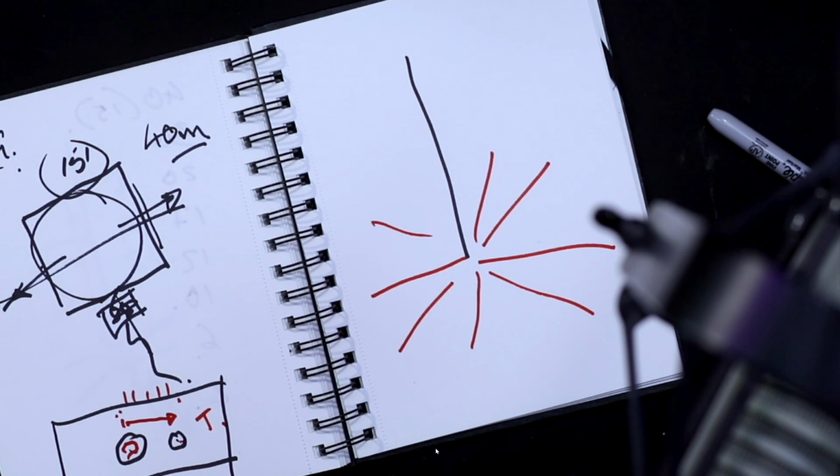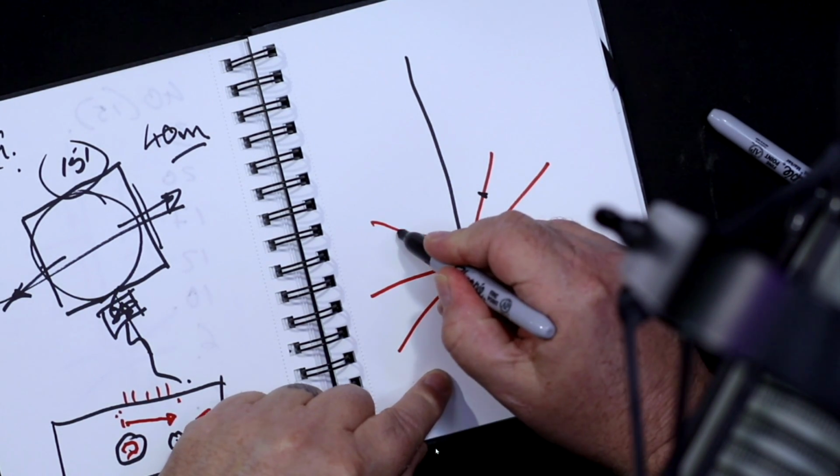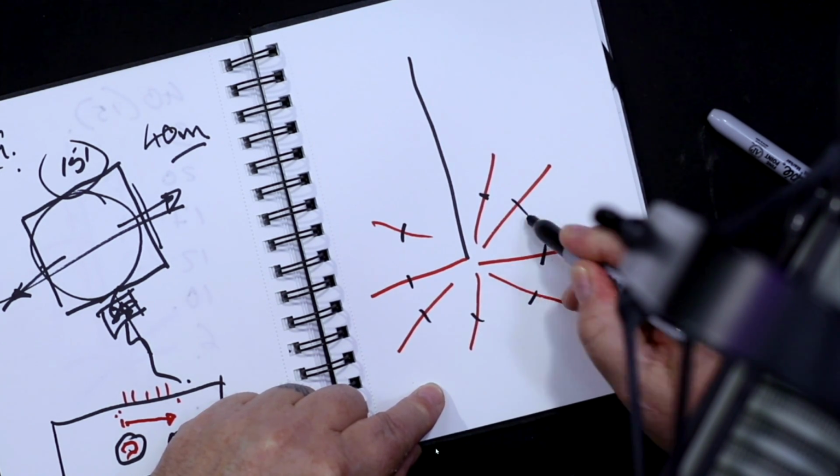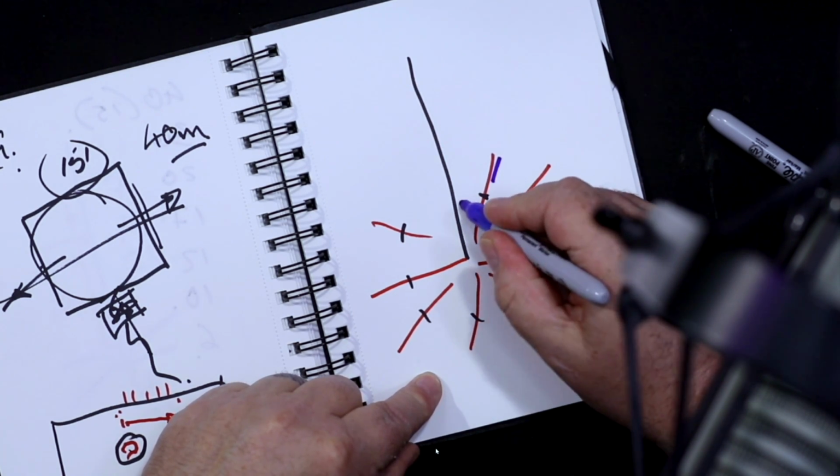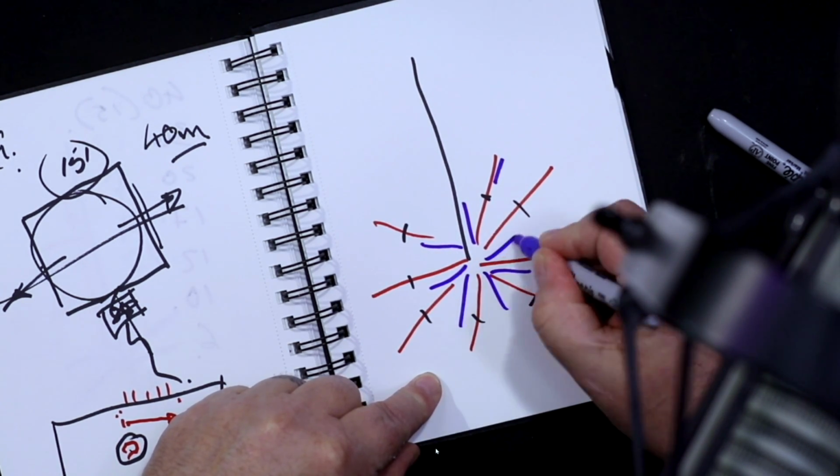And then, sort of the final part of the jigsaw, he thought, I wonder what happens if I cut all these in half, just literally cut them off. Again, 8, 16, 32, whatever else. And I'll take these bits, but I'll add them back in. So these are now eighth wave radials. And what he found was an insignificant change. It was measurable, but it's like 0.1 dB difference. So a lot of people think that ON4UN, the Low-Band DX book, absolutely insists on quarter wave minimum radials. You don't need that.